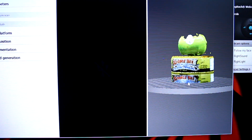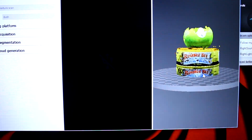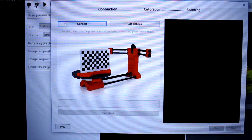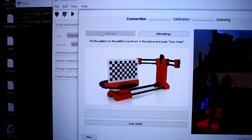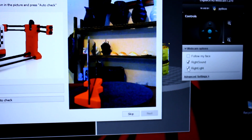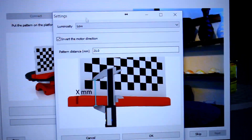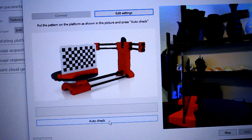Keep in mind that the scanner is only going to scan what it can see above what your calibration unit is. You'll probably want to either place something there or change your calibration so it sees that area — which I did not. With the wizard launched, it's going to connect to the scanner. The board responds and you can actually hear it. The lighting can be an issue — hit that right light button and double click it to fix the lighting. You can also do more setup in settings. I've got mine set to 21 millimeters and I inverted the motor direction.